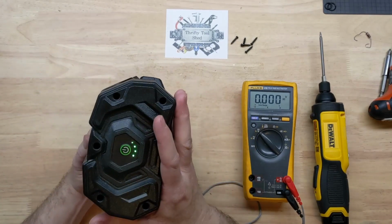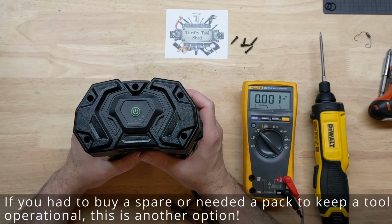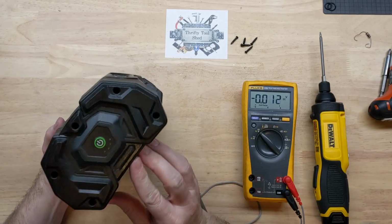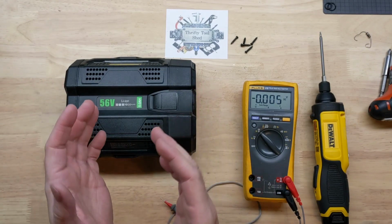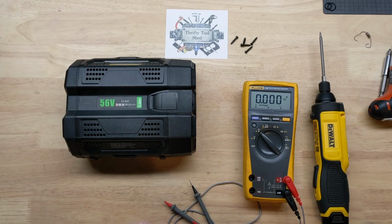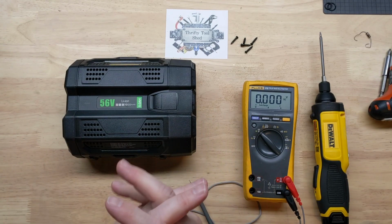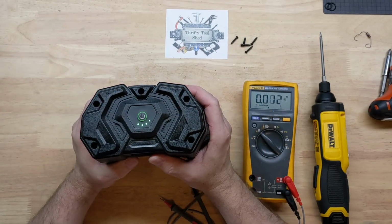This is still the only battery that I have that actually has the fuel gauge on it, that actually gives you the actual power level, besides just above like 15% or so. So it's kind of my go-to battery, honestly, because it's handy. The only issue I have with some of the first and second generation Egos is with that green light showing 15% or above charge, it doesn't do much good when after a month they self-discharge to 30%. So you really have no idea when you grab a battery if it's been discharged to 30% or if it's still at 100% without putting a meter on it. So I don't have to worry about where the charge level is, because it lets me know.